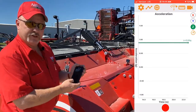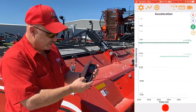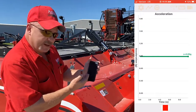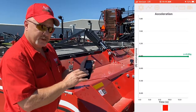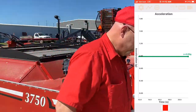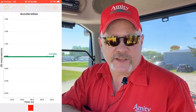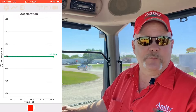I'm going to go and start the tractor, turn the PTO on, bring it up to 1000 RPM, and we're going to let this run for a short period of time. I'm going to start recording on my phone right now — it's going to start feeding a line across our screen that's basically a stable line. We have no shaking yet. One thing we want to make sure of is that our PTO shaft is parallel to the ground — we want that PTO shaft as straight as possible. We do not want it sitting on the parking stand, so we want to lift those up so we get a true reading with nothing affecting our vibration. I'm going to engage the PTO and slowly take it up to 1000 RPM, which is field operation, and we'll take a reading to see if there is any excess vibration in this machine.